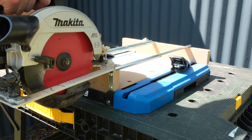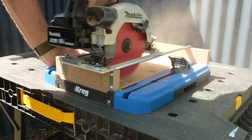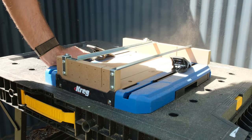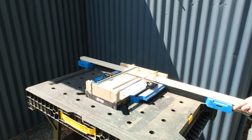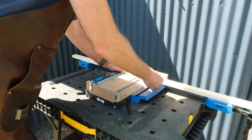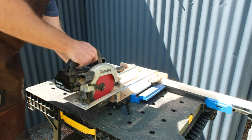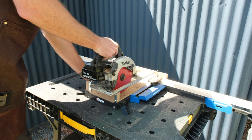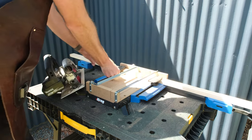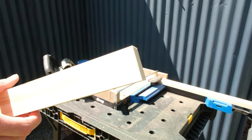Once you've done that, do your curve cut. I've taken it outside and I'm going to run a cut all the way through. Make sure you set your depth so it doesn't go too far into the MDF base, just a little bit so you can line things up — it's nice to have that kerf line. Now we're actually going to use this thing: the wings are in there correctly for support, and we're going to cut this piece of trim work. I slide the clamps up and push it so I'm cutting directly into the fence this time. You see — perfect cut. On the original one there was a little chip-out, but this is perfect.